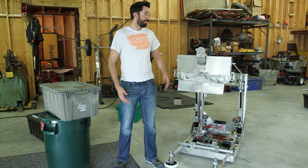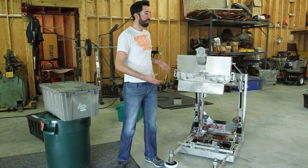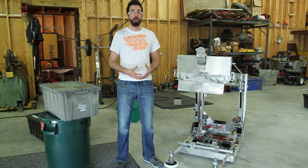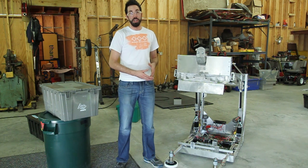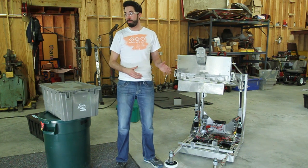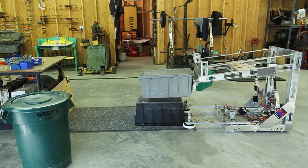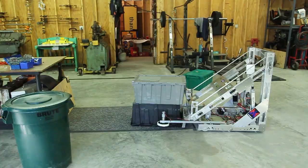If we were to improve this overall design, we would make it one uniform piece instead of scrapping together several pieces. It would be more uniform, more seamless, and integrate well with the rest of the systems. One reason we went with a passive system for our grabber instead of an active one is simplicity. With an active system we'd have more control, but with this passive system, a lot of teams can implement this generic design and expand on it very easily. It's also easier to test, tweak, and replace if something breaks. The biggest disadvantage right now is we're only able to lift totes in the upright position — totes that start upside down at the beginning of the game cannot be lifted in this configuration without first manipulating them upright.